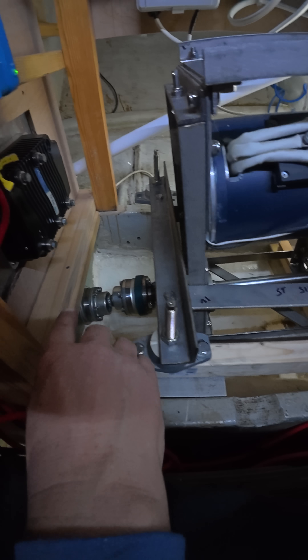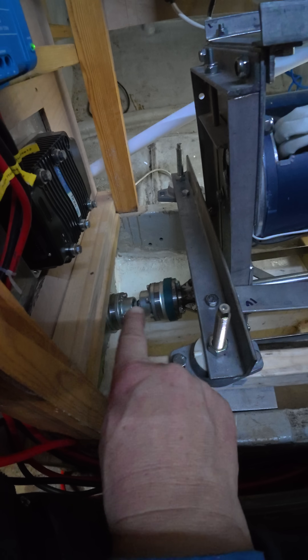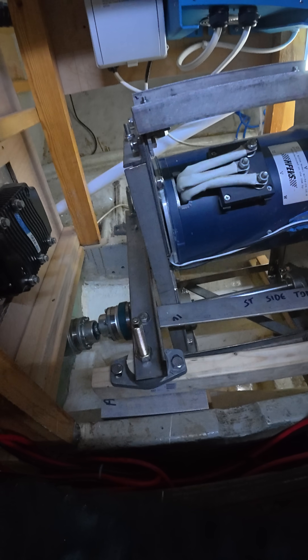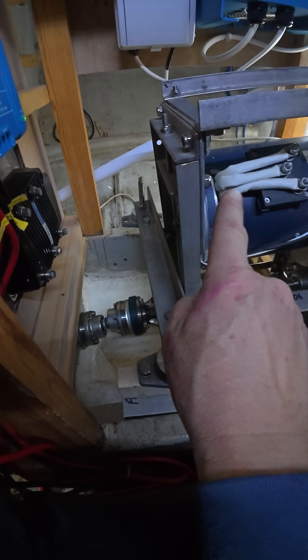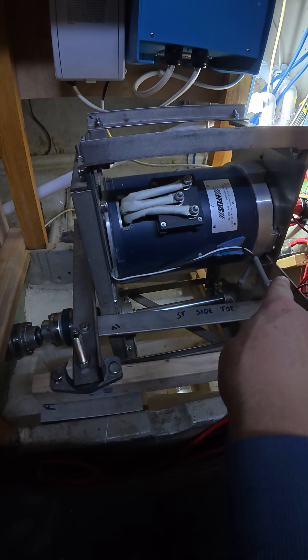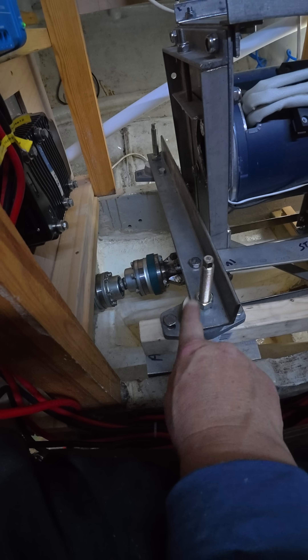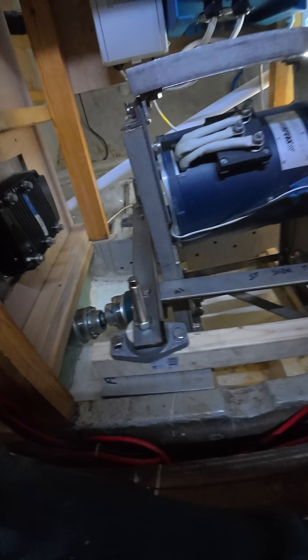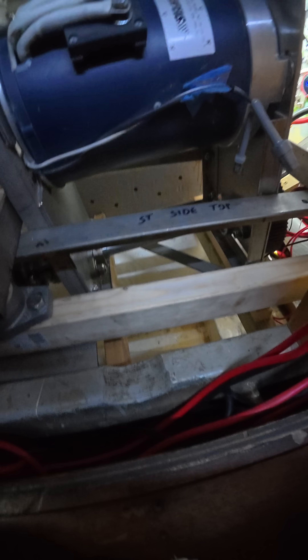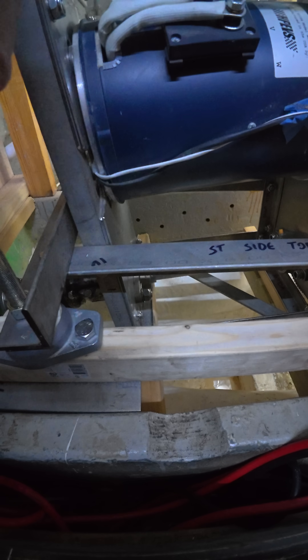It's very slightly high — that's the aqua drive there, which is not quite perfectly aligned. What's happening next is we've fitted one, two crossbars, and I've got the flexible mounts bolted to those crossbars. The next step is to have a piece of timber that runs the full length of the motor, so it goes under both mounts.